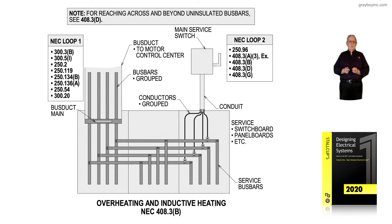If we have a bus duct going out from the enclosure and terminating with a main ahead of it, the same principle applies. With metal type enclosures, raceways, and so forth, the L1, L2, L3, and neutral have to be routed together for that particular phase.